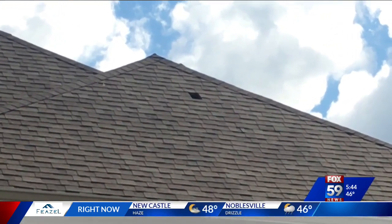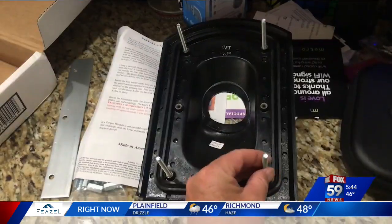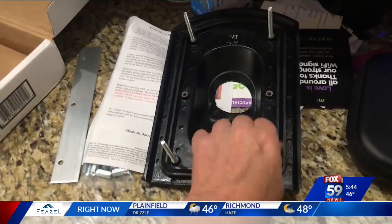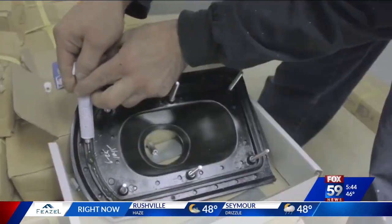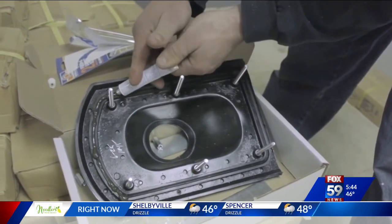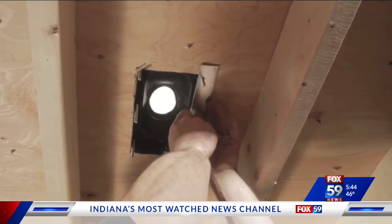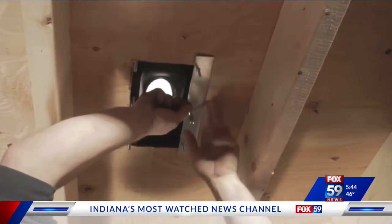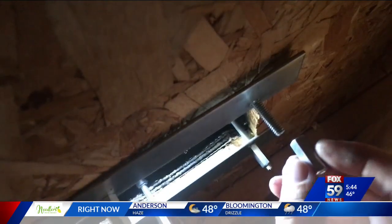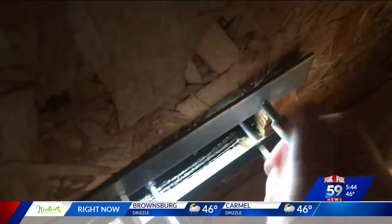Here's where you put the cozy collar through the roof — that's where my hand is. But before you do that, screw in the provided bolts. I did it on the kitchen counter because it's easier. From there, put the included sealant in the cozy collar's channel — it makes it watertight. Then put the boot through the rectangular roof hole at an angle to get it outside. Don't drop it. Turn it so it's facing the correct way and so the posts come back through, then lower it down. Put the two metal plates onto the bolts and tighten them down by hand with the provided nuts — this is what cinches the collar to the roof.